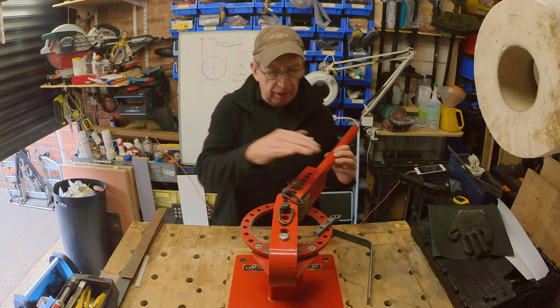Just the same as when I talked about the roller, hopefully you're going to have a dimension of where the fold is going to be. You'll have your piece of metal, mark that point which is your fold, and you'll have a dimension from there to there, plus an angle you want to bend it to. Let's say I want to bend two inches from the end of this steel.